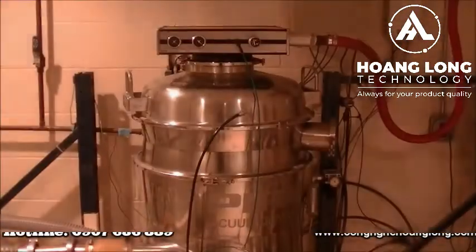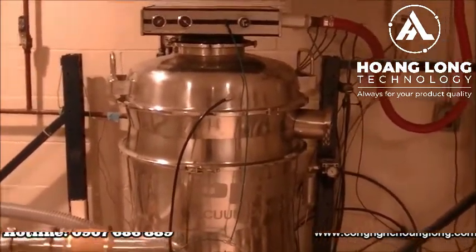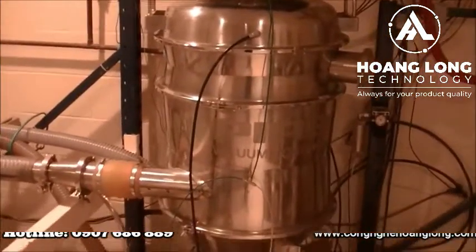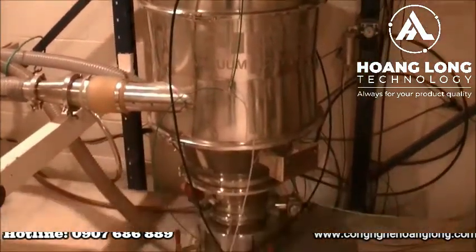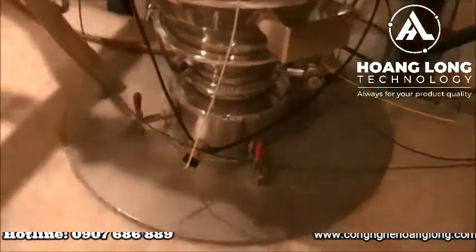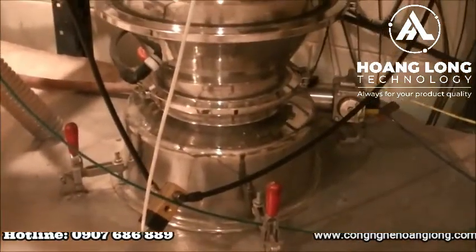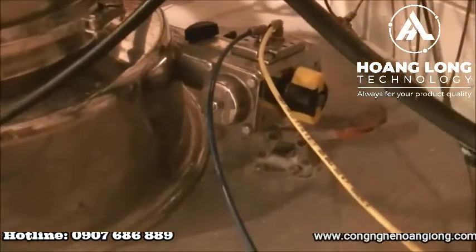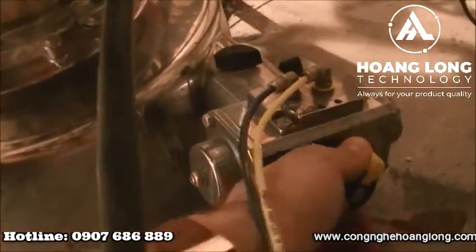So here we have our PIAB. This is an older model but still good for lab use. 56 body, so it's the piFLOW P56. We have a discharge cone down at the bottom with the bottom valve flap contained behind that module, controlled by a pneumatic actuator. The valve is currently in the open position. The indicator, when it's horizontal, means the valve is in the closed position.